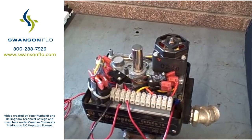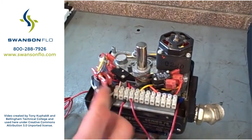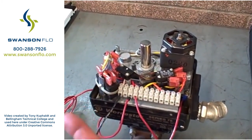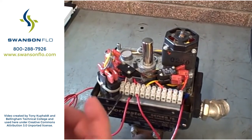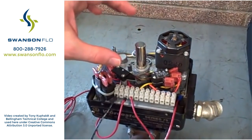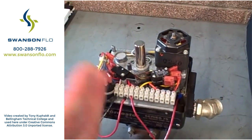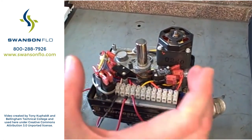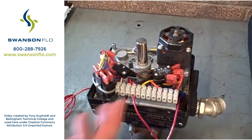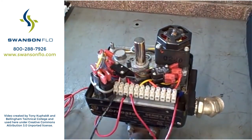They also have MOVs with electronic style limit switches — not strictly mechanical. They might use counters like encoders to look at the valve position very precisely. You also have some MOVs that actually have a potentiometer or an LVDT or some other sensor that's able to give an analog reading of that valve's position. Using that kind of mechanism with the appropriate servo circuitry, you can get the valve to proportion — so you could send it a 4 to 20 milliamp signal and have it proportion itself according to that analog signal.